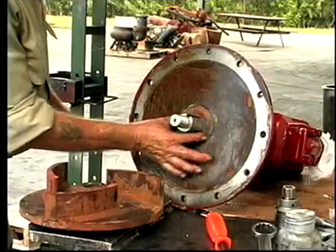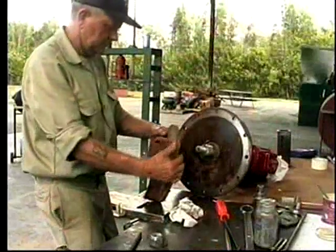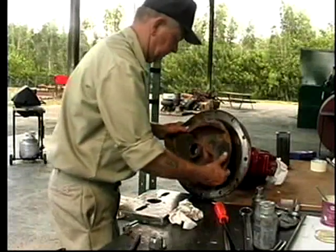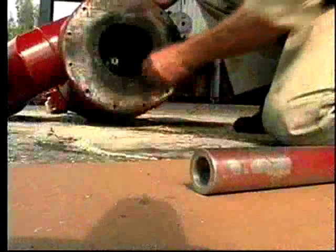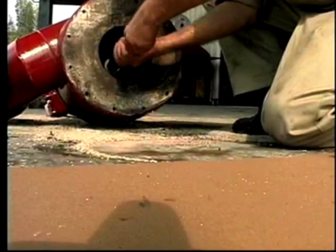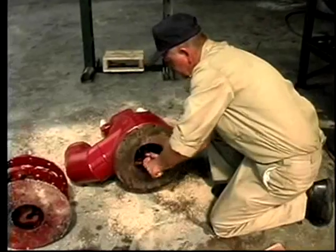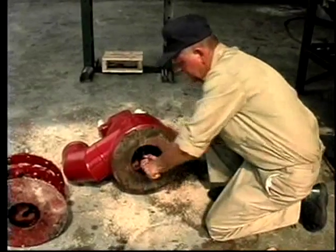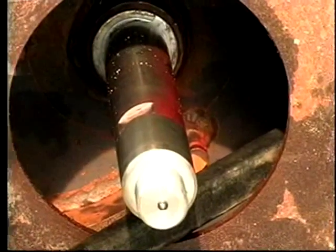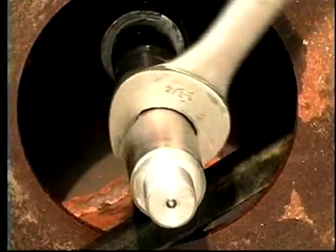Install the flinger — this lays on top of the snap ring. Install the impeller's shaft key and install the impeller. Install the stub shaft washer and thread the stub shaft onto the main shaft using standard right-hand threads. Tighten the stub shaft with a wrench on the flats of the shaft while blocking the main impeller from turning.